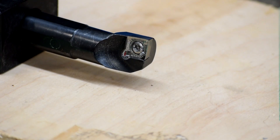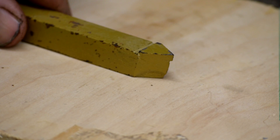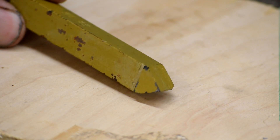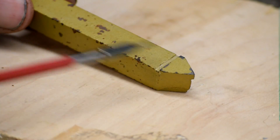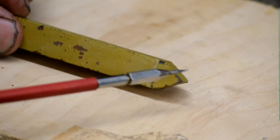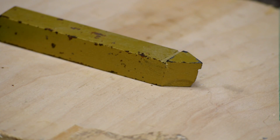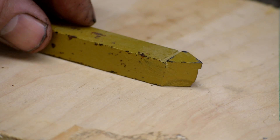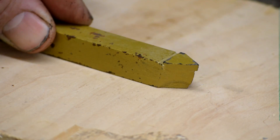This cuts with less power and a better surface finish than the carbide does on aluminum, which is great for people with small hobbyist machines like mine. You've probably also seen these brazed carbide lathe tools. This one here is a 60 degree tool for threading — a cheap one. They've painted the whole thing gold right down to the carbide. These have their place; I had a job where high speed steel wouldn't touch it at all and the only thing that would go through it was carbide, and in fact it wore the carbide down the piece was so tough. So there is a time and a place where these things can be useful, but this is not something you want to be using on aluminum.